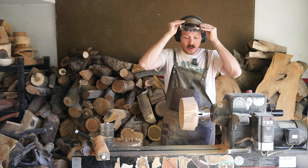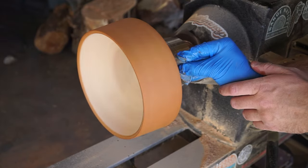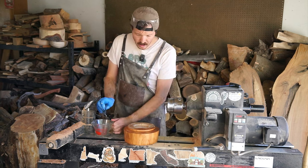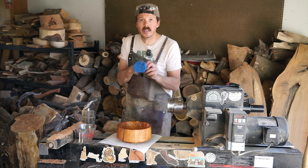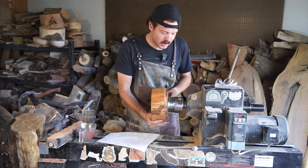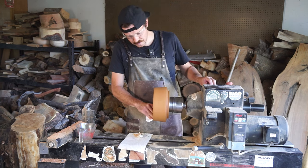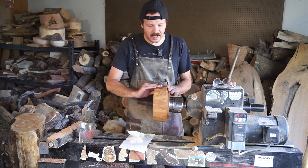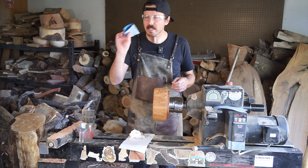Now it's time to add our oil finish. A nice thin layer of a food-safe oil finish here — going with Walrus Oil, using their cutting board oil. So I'm going to let this cure overnight. It's the next day and this is feeling cured enough to move on. I'm going to speed up a little bit. It feels really nice to the touch, but I am feeling like I want to throw a second layer on this. Our first coat I applied with a 320 grit sandpaper, so for the second coat we're going to step it up to a 400 grit.